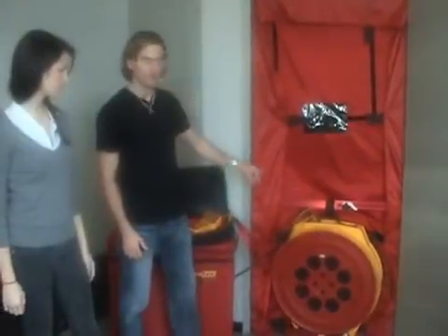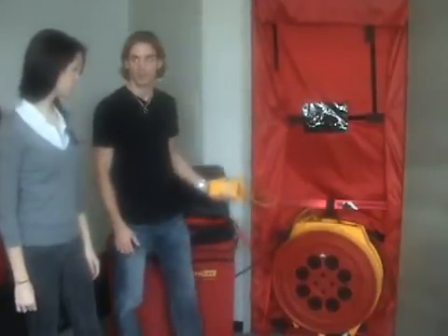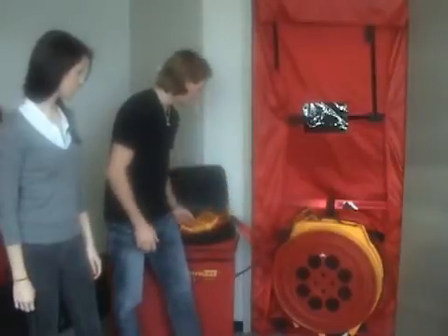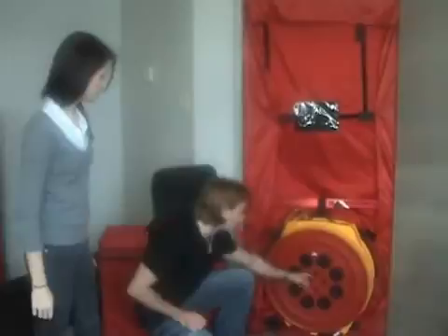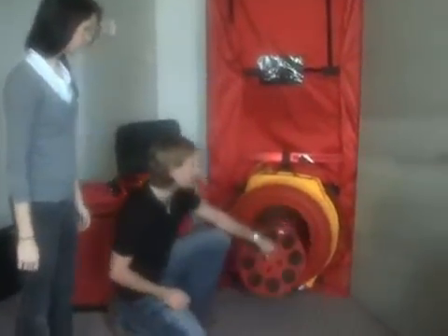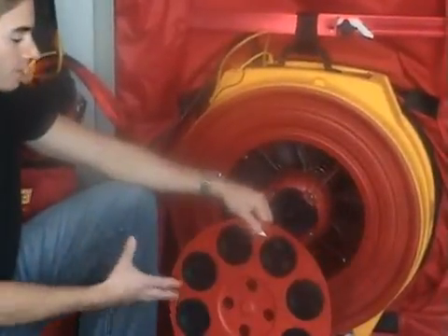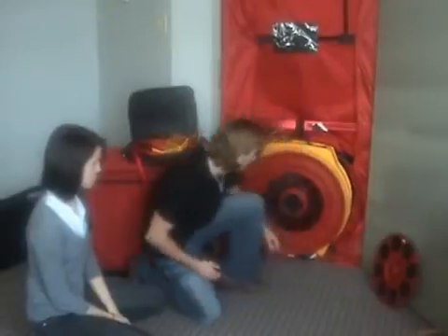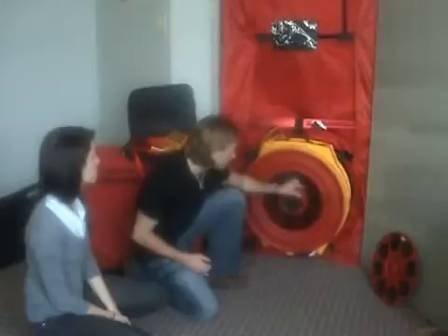By the fan top there's a green status light. When it's solid, it indicates that the fan is receiving power from an outlet and has clear communication from the DM2. Those black plugs are the ranges. This particular model of the Q46 has 11 ranges, and these ranges allow more or less airflow into the fan to get an accurate flow reading. As you can see when we take off the C8 range, the fan has 8 motor mounts to make it a nice solid firm mount.